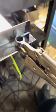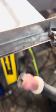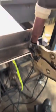I have the machine set to 90 amps, which is what Cas recommends. I have the tungsten recessed inside of the cup by about 30 thousandths, and then it fits right in there.